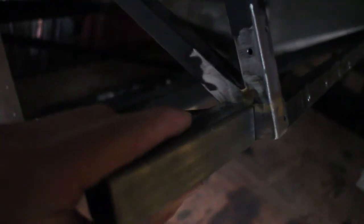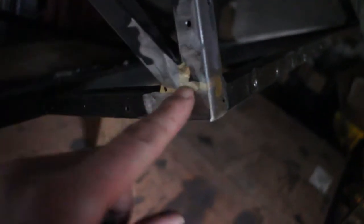Well, you can see I've taken that corner back to bare metal, and I'm going to put a 1-inch tube somewhere around here. Just need to measure it up, but underneath and on this side it's nice clear metal, but I've got that brazed portion around there, so I don't think I can avoid it, so I might have to either add a bit of structure around it to support it or go for a full TIG braze on it. I really don't want to do a TIG braze because I know it will just spit at me and it might cause more damage in this corner, and it's quite a critical corner. So yeah, I might go for the build up around it option and put some bracing here or something instead of welding on here.